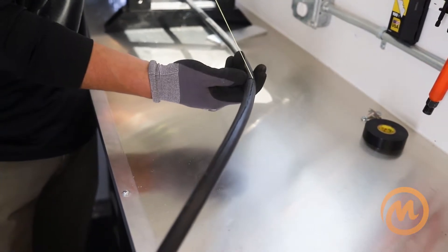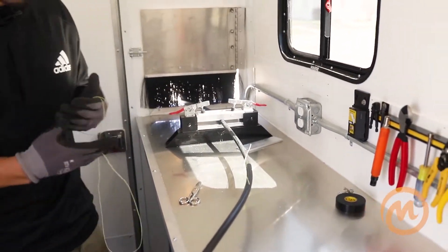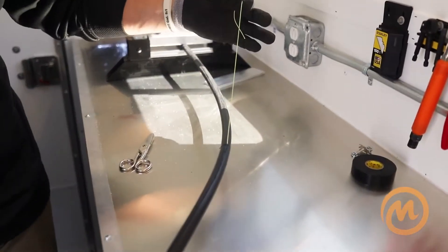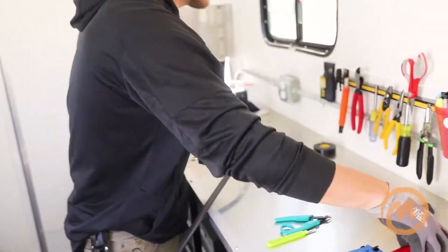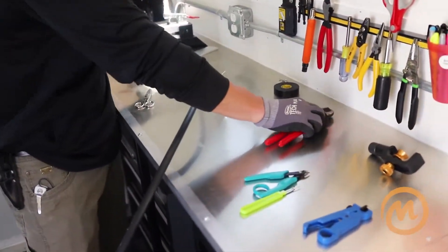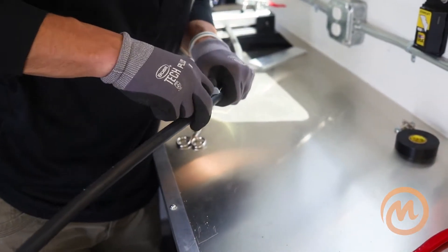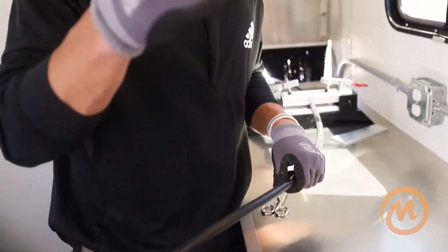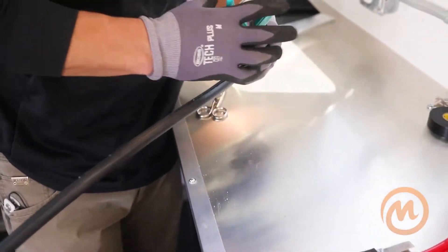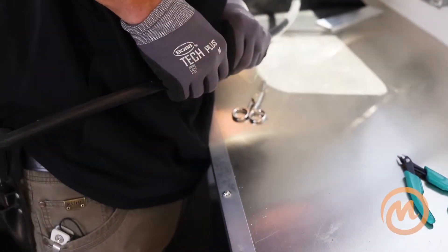You pull it to the base — your prep base right here. Try and get to the base where your base score is. Always leave about a foot of your rip cord for future steps. Then go down to the base and peel just like we did up top. These flush cuts come into play here — make a little snip through the armor and just peel back. Sometimes it gets pretty tough.